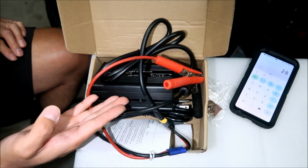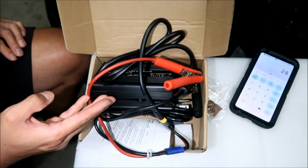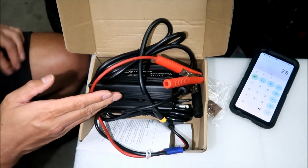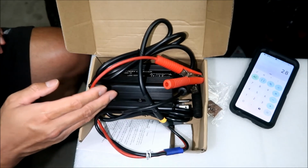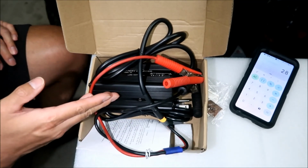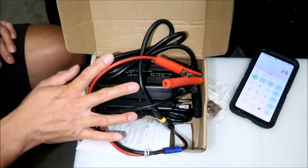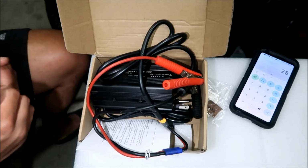So yeah, there we go. That's the plan. All right, so hopefully I'll get that BMS this week and we can assemble the battery already. I don't think it's going to take as much time as last time. We also still have to make cables for the battery. We need cables to hook up to the inverter, the inverter charge controller. So that's going to be the last thing. But first we need to charge the battery, right? That's the important thing. We need to charge it and top balance it, and that's what we're going to do with this guy. Okay, and then we'll plug it all together, and then we'll have double the battery capacity.